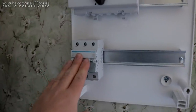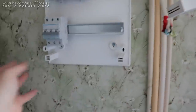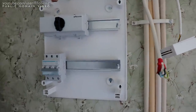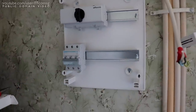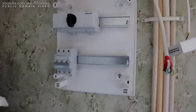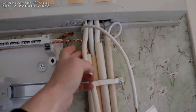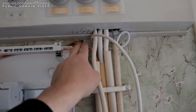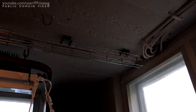This is going to be the breaker for the three-phase outlet I'm going to put right there, because I want a three-phase outlet just for testing stuff - it's very useful. Also if I want to help out my neighbors in case of a prolonged power outage, it's good to have a three-phase power outlet. Might as well put it in since we're doing all this work - it's a trivial cost now. And I did pull a new raw copper lead for the ground potential equalization. Let's head downstairs and see what's happened there.